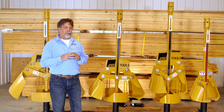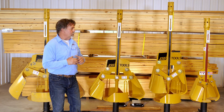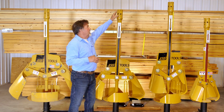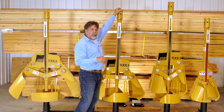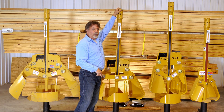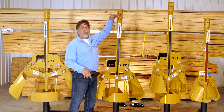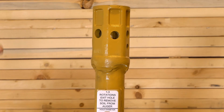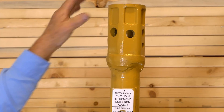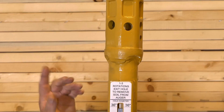Let's say you've got a 65 horsepower skid steer and you need to use one of these augers. All of them are designed with a 2-inch hex coupling right here. We don't want you to shear a bolt 14 feet in the ground and not be able to get the auger out. So we put a hex drive on. You can put a shear bolt coupling at the top if you want. If you have to go deep — we've had them as far as 14 feet deep — there's a 2-inch hex coupling here.